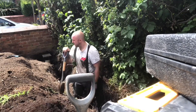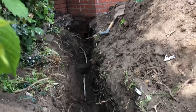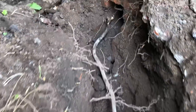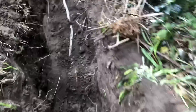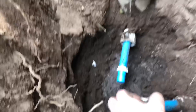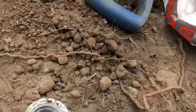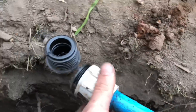Here we go. We have dug our hole — a big one. It was slightly off to the right from where I was, but we've got it and we're through. So we're going to change this over now to blue alkothene MDPE pipe, 25mm. As you can see, whoever put this one in — just taking this off — this socket, there's actually nothing wrong with it, but whoever put this on hasn't used a liner — a bit naughty really.